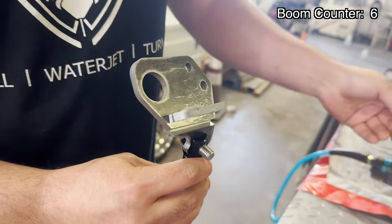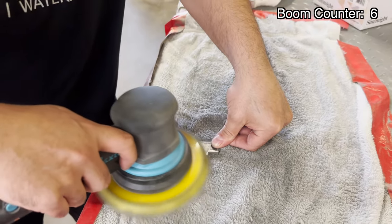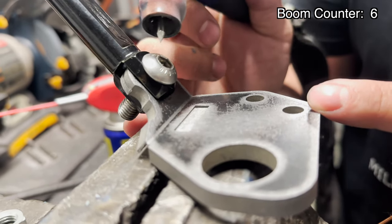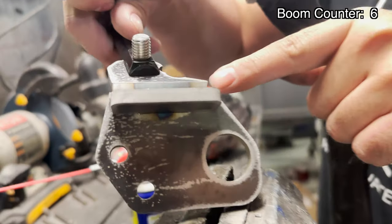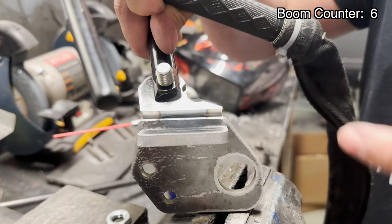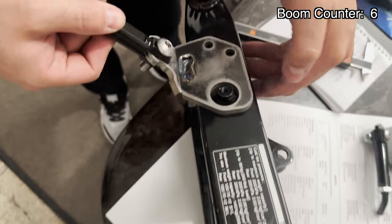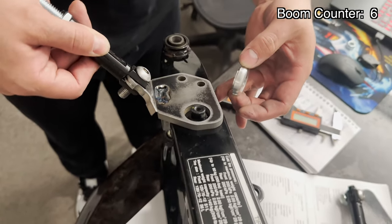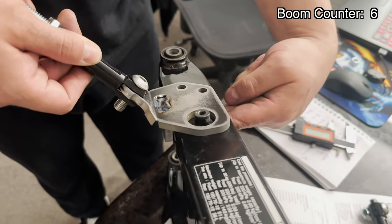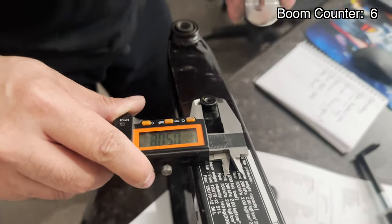This will sit on the swing arm, so we're going to give it a quick buzz with the welder — head over to the welder and then try to put it on the Grom. We're going to give it a quick fuse weld, just kind of melt this together, and then fill in that gap on the other side. I'll probably fit this up to the Grom first so we can adjust the angle we want it at, and then we'll weld it when it's all set and done. So we'll head over to the Grom, bump this thing on, and see how it's going to lock in place. We're going to machine out a washer for this — we'll probably use our kickstand puck washers, bore it out so that step slides in, and use an M6 bolt to hold it in place. Once we're holding it in place we'll use a drill, use this as a drill guide, and put that plate in the back. We'll do some testing — we're slightly over a half inch — we'll just get a half-inch drill, throw this on the lathe, bore that out and see how it works.